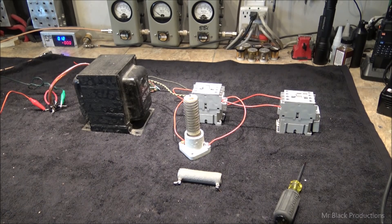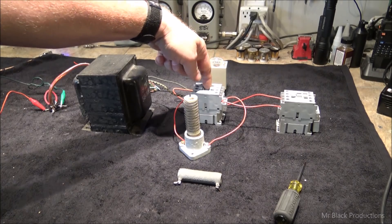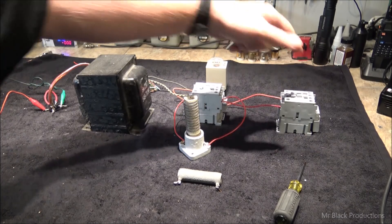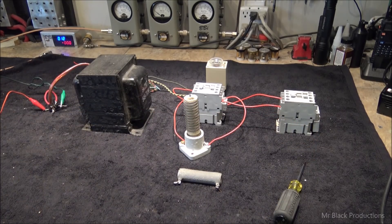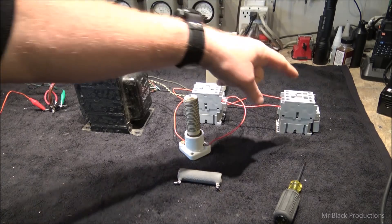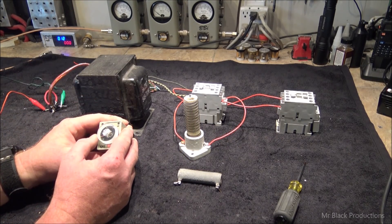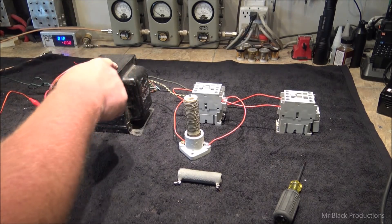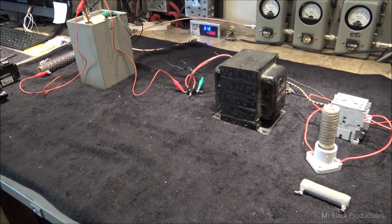Now this is the most tricky part of the whole circuit. You wire in the timer on one of the legs of the contactor, so after three or four seconds — click — this closes. You have to tie this timer to this contactor or to this breaker. When you initiate this process, the electrons that flow from the beginning source at the breaker or the contactor have to energize the timer. The timer will count down — one one-thousand, two one-thousand, three one-thousand — and clap! On comes your high voltage, giving the transformer the full current available to it from the circuit, fully charging your high voltage cap. That's it — that's the soft start circuit.